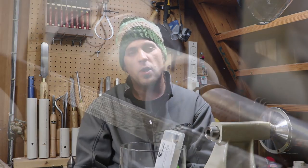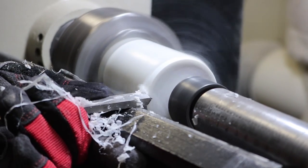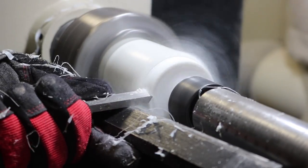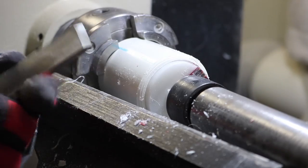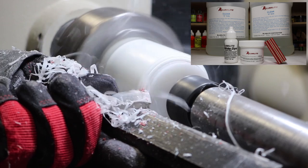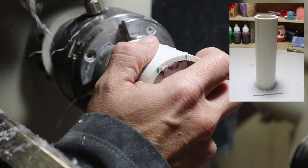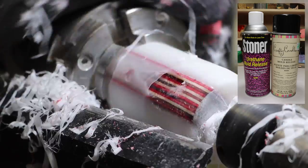Next up, a short little video. I'm starting out with my negative rake scraper, and then I'll use my skew chisel to create a nice tenon so that I can reverse-chuck this piece. I used alumalite clear resin with some white alumalite dye, pearlescent powder, and just a small strip of Spectraply. You'll notice that's the two-inch PVC I used as my mold with some corrugated plastic at the base, sealed with hot glue, along with a couple of options for release agent.